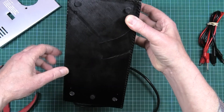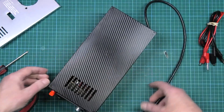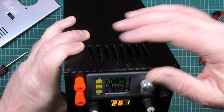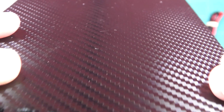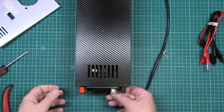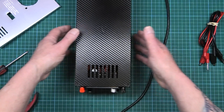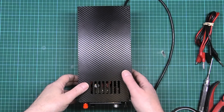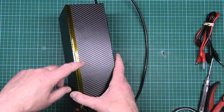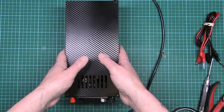I've put three feet on it - don't put four on because a 3D print is never level. You've also got the output for the fan which you can adjust. You can feel the air coming out - it doesn't get hot. I usually have it on about half speed while pushing out five amps and it's fine - none of the FETs get warm, there's loads of air circulation. As a final touch I put a bit of Kapton tape around the top to seal it - there's no air output through that gap, it just holds it on properly.